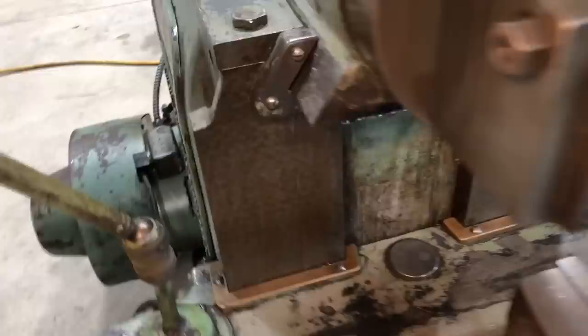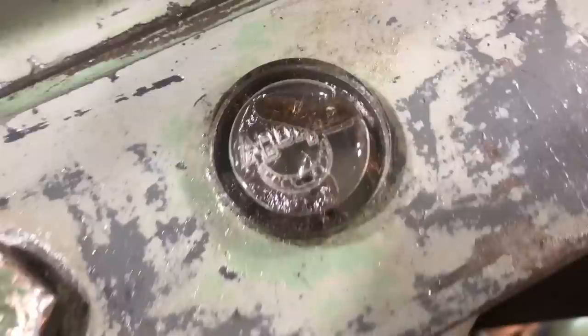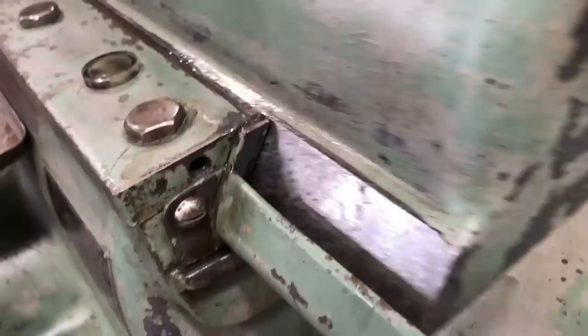Because you can take a piece of cast iron, if it'll fit on a grinder, and there's some big grinders. If anybody saw my planer being ground up at Kinetic, there's some big grinders. Oh yeah. But not every piece of equipment is easily moved and put on a grinder. But let's just say that they could be, and you had two ground surfaces next to each other. They could be so flat that if you put them together, when you put oil in there, they would remove most of the air, and they would stick like nobody's business. So they really would have a high coefficient of friction, I guess. Somebody who's a physics major will correct me if I'm wrong with that term. But they would have a high level of friction, and they wouldn't want to move easily back and forth.